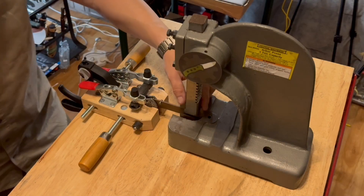What is a mystery to me is why they coated the corrosion-resistant blade and left the D2 in the white. And speaking of D2, let's test it. Applying that gel again. Crucible recommends 59 for D2. I personally would prefer it at 61, because with a robust blade geometry I think we can handle a little less toughness — especially because I'm a sharpness junkie. This device detects when you're striking too close to a previous divot and gives you an error message. And look at that — my average is 61.